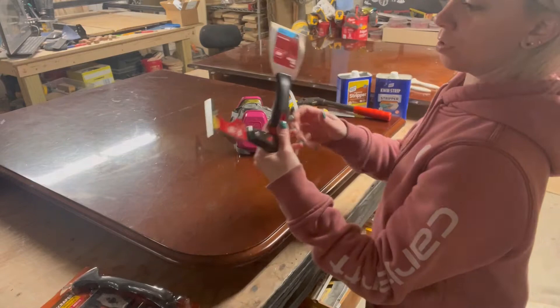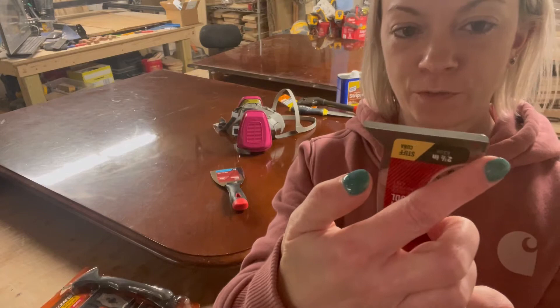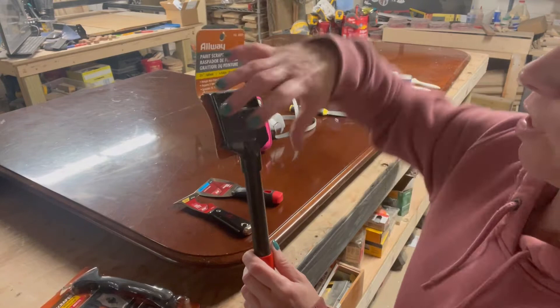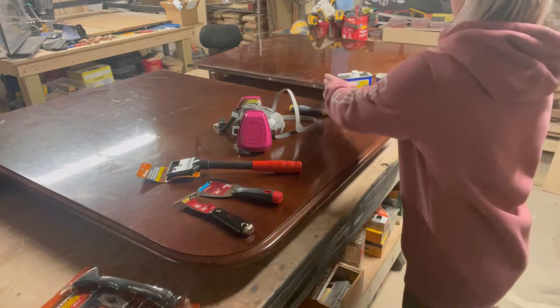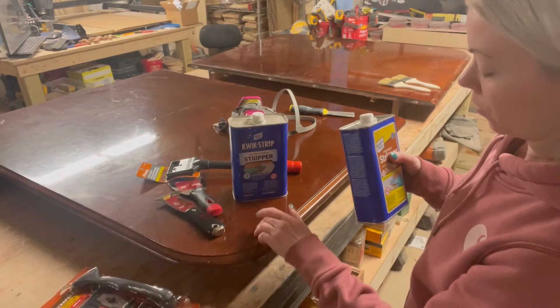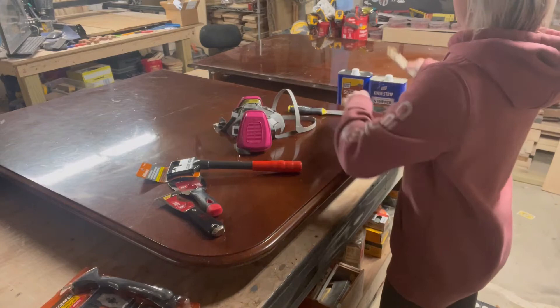I got some new scrapers. I know this is for a paint roller, but I happen to like this edge and this edge for scraping furniture — it helped me a lot on the previous piece. I got a brand new one of these, another scraper, brand new. And then I got this one — it's got four edges, rough and fine scraping, both covered. Hopefully this helps me get the leverage I'm going to need. I have the Quick Strip varnish stripper that I used on the French Provincial dressers, and I also have this premium stripper. I'm going to see which one works better on this specific varnish.